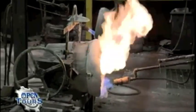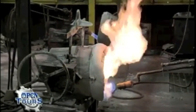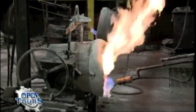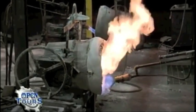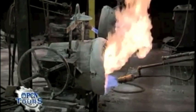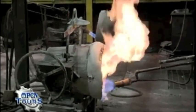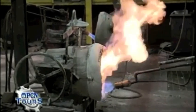The bowls are made of cast iron and steel and lined with a special liner that can take intense heat of well over 3,000 degrees. The metal going in is around 2,800 degrees, so there's no way the bowl will fail because of the intense heat — it can withstand the heat of the 2,800-degree ductile iron.